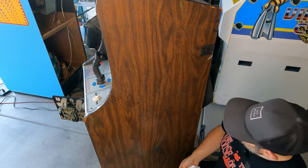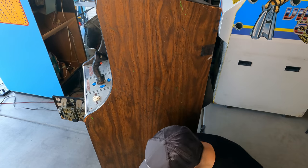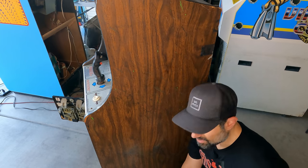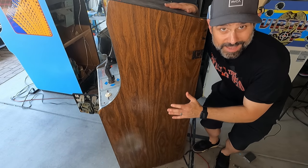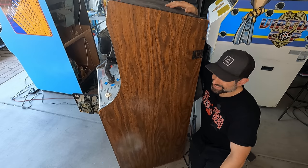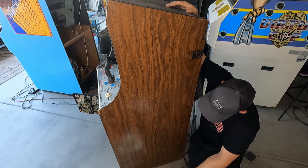This isn't perfect — there are still problems with the cabinet, like some peeling at the bottom — but it looks really nice. Depending on whether you want to do a full restoration or not, you may be able to solve your problem with just this. So again, it's citrus strip — you can get it anywhere. This one's called High Speed Ready Strip. I'll have a link in the description; I just got this off Amazon. We're almost finished — it looks a lot better. Get a damp rag and wipe the rest of the excess off. It does an amazing job. There's some residue from what looks like duct tape — I can get that off with some Goo Gone. It looks really good outside of the bottom being a little bit damaged.